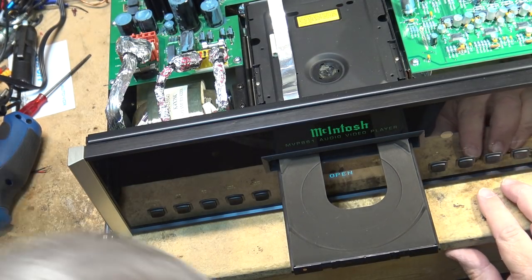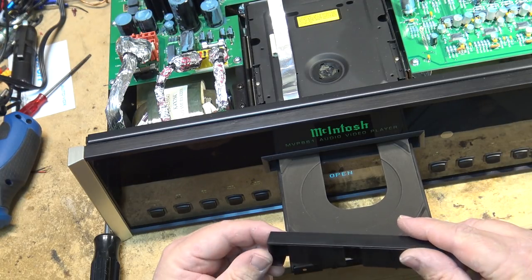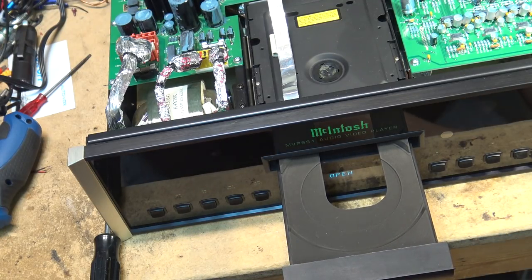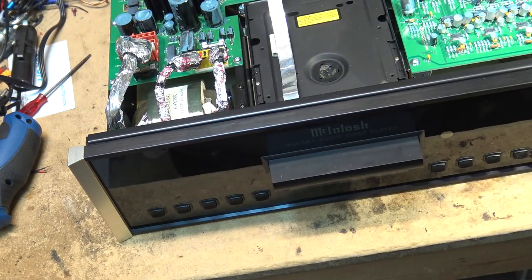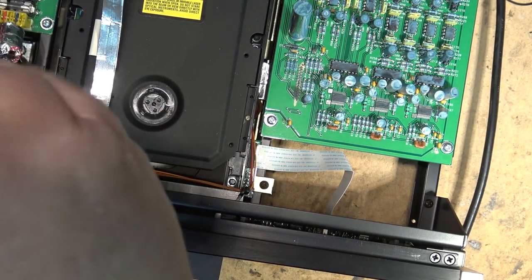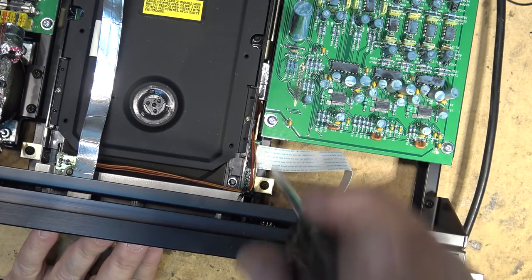Okay, now put the nose piece back on and make sure that it's going to close properly, because I think I'm still a little bit too high. So that's what this adjustment is for. How's this go on? Goes on like this, I believe. I'll just close this without power on it. That's going to hit, so now I'm going to lower down those screws to make sure that this fits properly. That's why these screws are on springs, so that you can adjust the height so that it'll fit exactly center. You can actually level this thing off. Like that. So it's right in the middle.